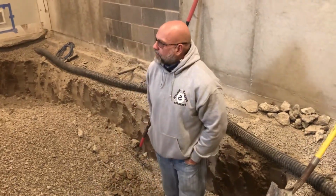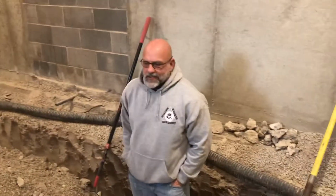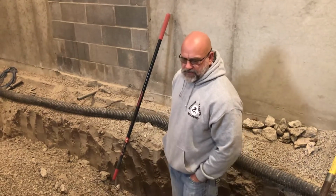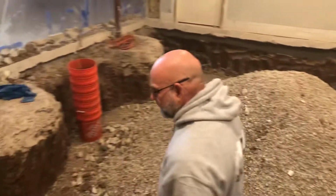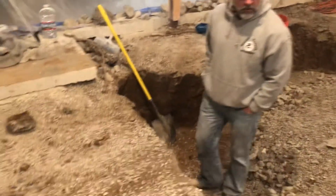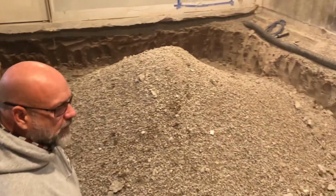We got our King Piers team out here, Sillers Construction and King Piers working together on this project. This is a golf pit that we're digging. It's going to be a 2-foot wall sitting on a footing, and we're going to pour the wall and the footing monolithic. That means at the same time.